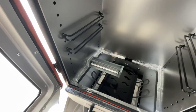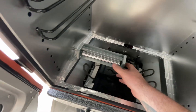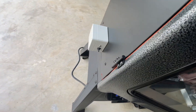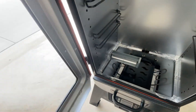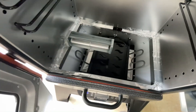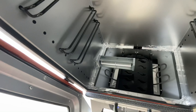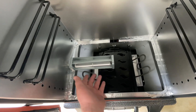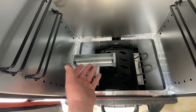The last thing we did: that is not part of the fan or part of the oven — we actually added this circulating fan, like a birdcage fan. We drilled the hole and mounted it through. On this side you can see the controller; it uses a 120V plug. We flip it on, green light, and it actually spins. What that's doing is, even though the element is being heated and it registers temperature at the bottom, you want that fan to circulate the air so you get an even distribution of heat through the whole oven. It's located lower, closer to the element, so the metal of the housing will heat up and keep that blower on the hotter side, helping push that hot air up.